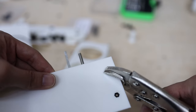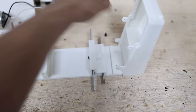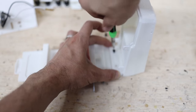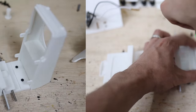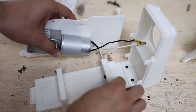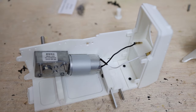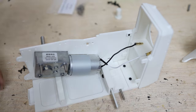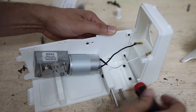At the bottom part we have to insert these 3mm nuts. Then we assemble the front of the chassis with the bottom of the chassis using 3mm screws. Now we bring the left part of the chassis to the central part and connect using M2x6 screws.